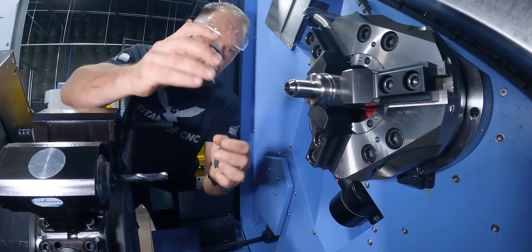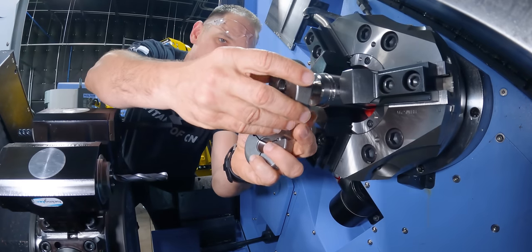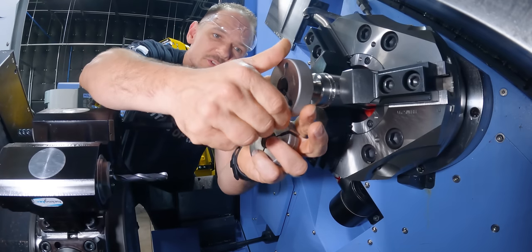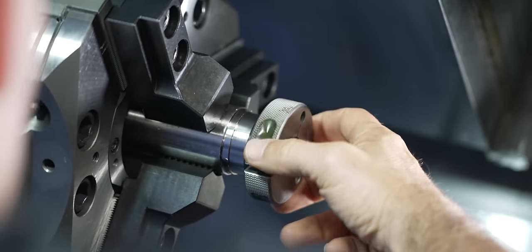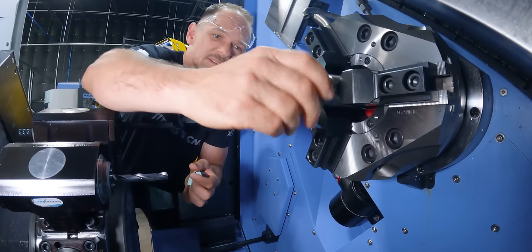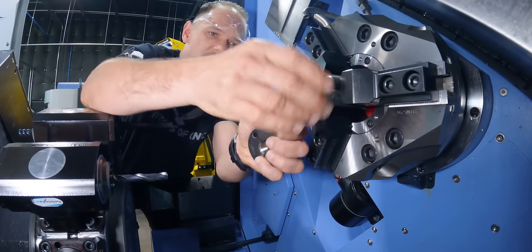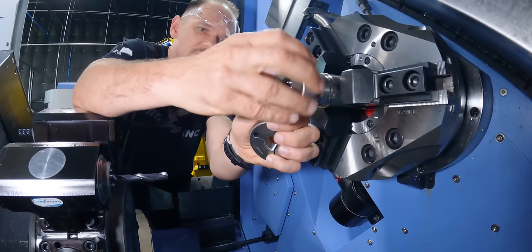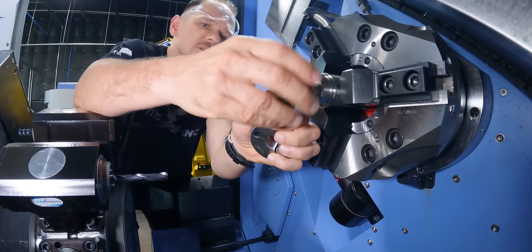And our last check is gonna be our ring gauge here. We got green for go. And be careful not to damage your threads. Make sure that it goes all the way down, because remember I talked about sometimes that thread can taper. All right, we're good there. Now, it's only half the check. You want to check it with your no-go gauge as well.